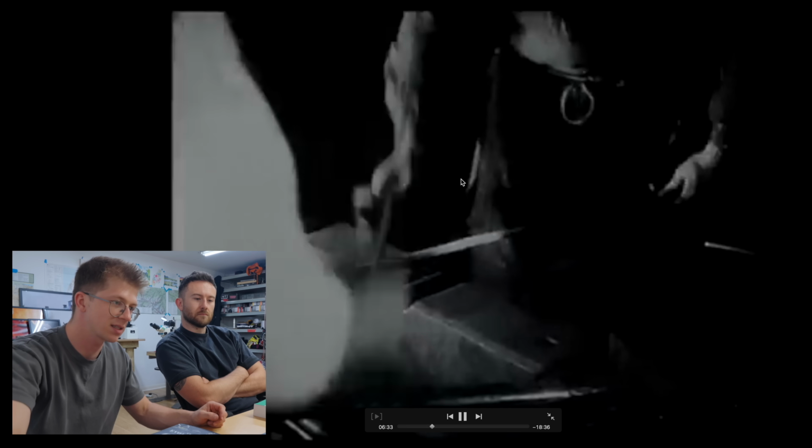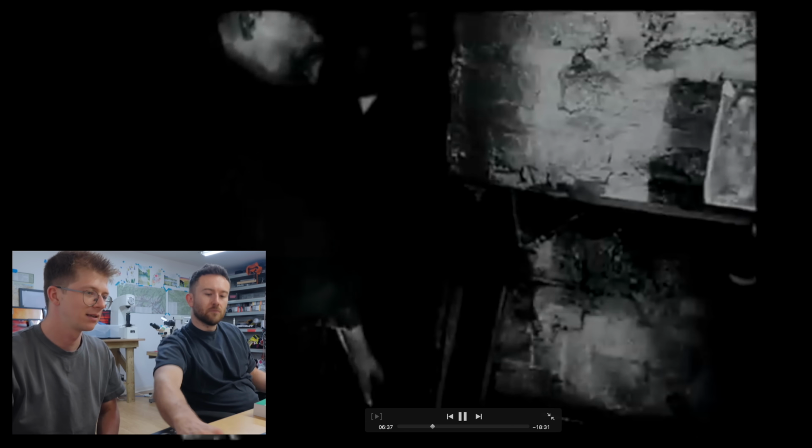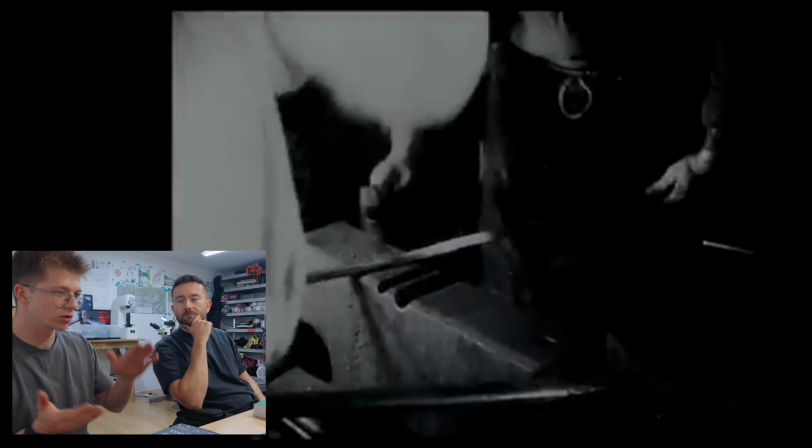The guy with the small hammer, he's the quote-unquote master, and he's telling the guy with the big hammer where to hit. Was this swage here? Is this swage in the anvil how they would have made those pipes previously then that we did? Well, I think that's still going to be relevant for this. Right. Because no matter what, you're working with a tube, you need to constantly kind of make it round. So once you weld it, you need to constantly be working it in a swage. Right. So that you're not making flat spots.